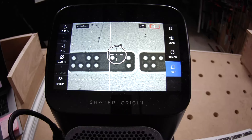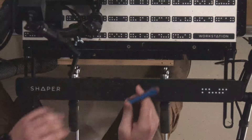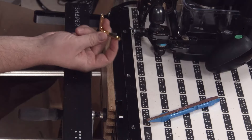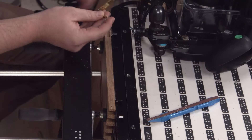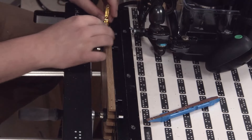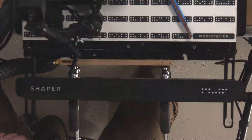That is the beauty of these hinges — they are so fast. Let's just knock off any fuzz, and before we take anything out, we want to check our fit just so we get a look at what we're doing here. This is the small Neat Elite Hinge. It's got a 93-degree stop on it. And this is cut to a zero-inch offset, which is just a perfect fit.